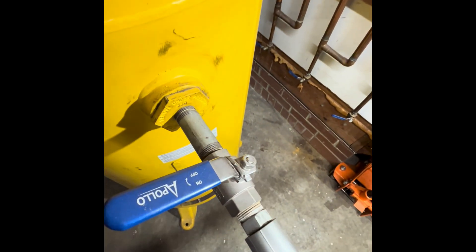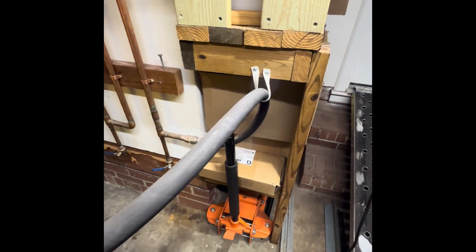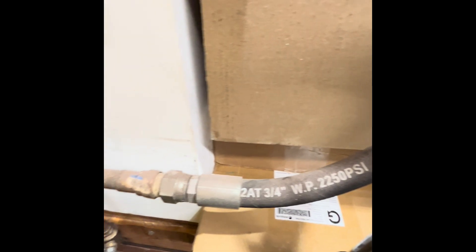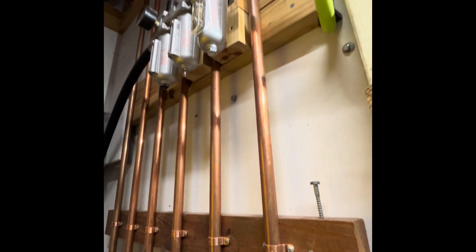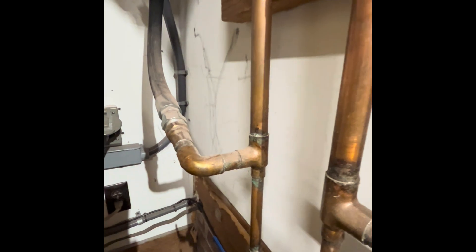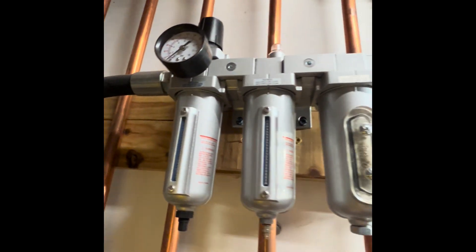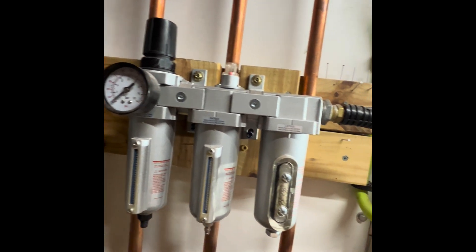Compressed air heats up and comes out of this three-quarter inch ball valve, through the hydraulic hose, and into the copper air drying system. Hot air goes up and comes back down through each of those copper tubes, makes its way to the end, exits through a second hydraulic hose and into the regulator, and then makes its way through this green Flexzilla hose.